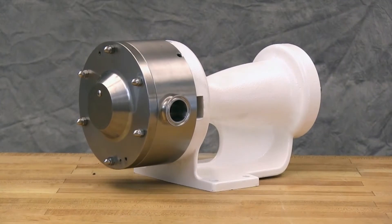It is recommended that new o-rings be used for reassembly of the pump. All o-rings should be lightly lubricated with a food grade lubricant that is suitable for the application before installing.